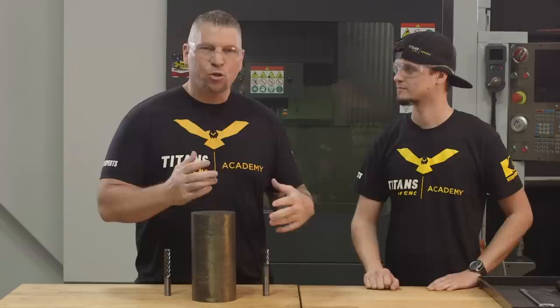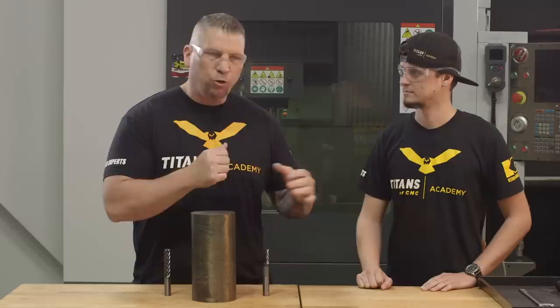So I'm in Pennsylvania reprogramming it. I sent him the numbers — we backed off on the surface foot and the chip load, gave it to Stuart. What happened? He threw in a new end mill, typed in the numbers, and on the first cut we got 30 minutes. Thirty minutes is not a good thing — I'm expecting at least 90 minutes in cut. So I made a few calls, we used a few different tools, talking to some of the best technical guys in the entire country. They gave us exact speeds and feeds, and the end mills are still breaking. The longest we could get was an hour; at one point we got almost 90 minutes, but we're just breaking end mills.